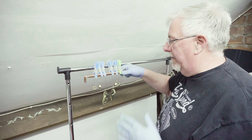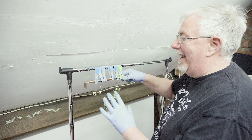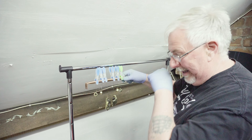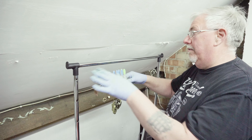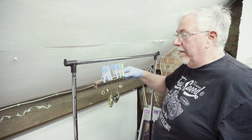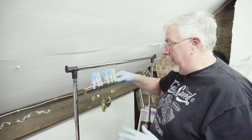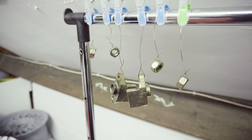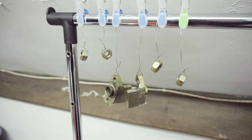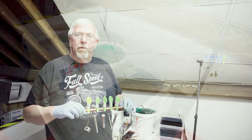I'm actually quite impressed with that. Now you've not got to touch them — you've got to allow them to dry naturally or with a little bit of heat and leave them for 48 hours. I've got this handy little rail — a special passivate rail — that we've managed to acquire. I'm going to hang them on here and leave them alone. That seemed reasonably good, let's have a go at the second lot.